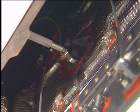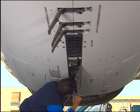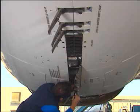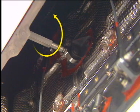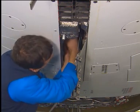Engage and operate the take-up device to pull the two halves of the thrust reverser together. Close the pin latches with the square drive handle. Disengage the take-up device and put it in its keep position.